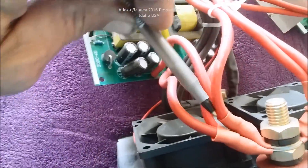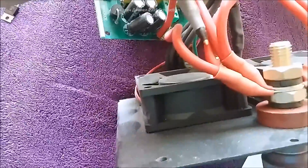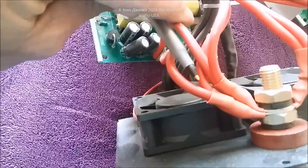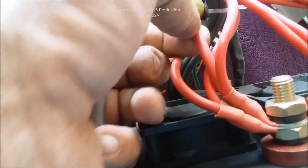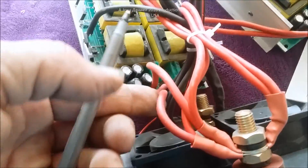Using an ink pen as a reference — which is basically 0.27 of an inch, just a little over a quarter inch — these wires are probably no bigger than 8-gauge at best. And that's Chinese gauge, meaning the actual gauge is being cheated.